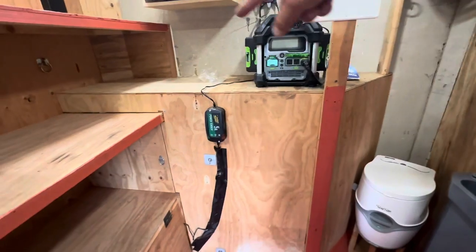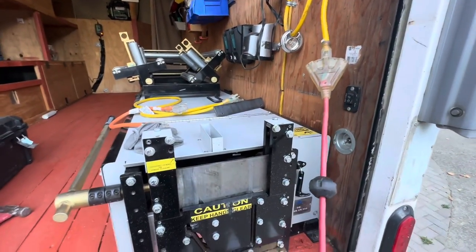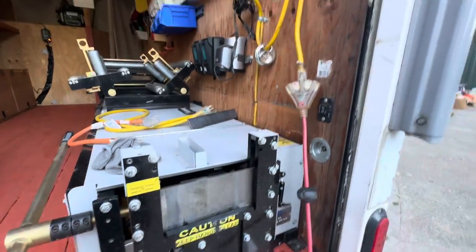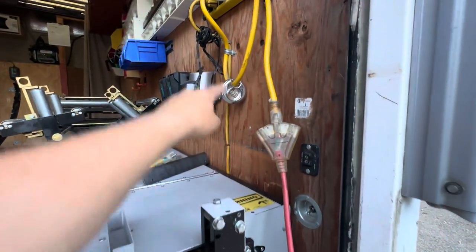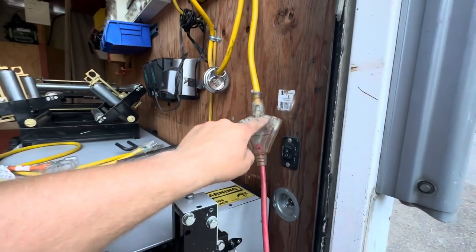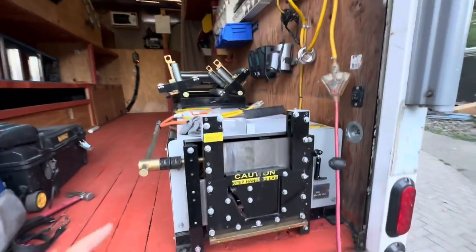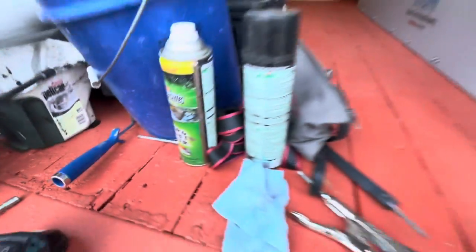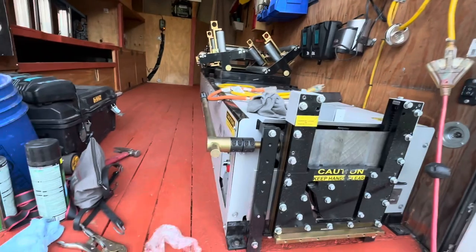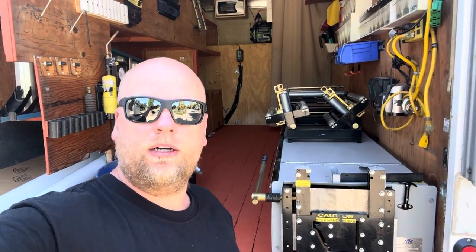This little build right here gives me that extra third seat inside the cab. Here's an example — I'm hooked up to the house, to the shop, and I can turn the machine on. This powers all the accessories; it's actually charging the generator — the power pack — right now. Once I'm plugged into the house I have power here. If I wanted to disconnect from the house I would take this off and put this cord into the generator cord and feed backwards. For the second machine, we have a hole in the floor — when the machine goes in, we're gonna have a wire underneath the floor connecting the second machine so everything gets powered with one cord. Anyway, thanks for watching, stay tuned for the final, and then we'll do a nice walk around with the truck when it's all done. Thank you and God bless.